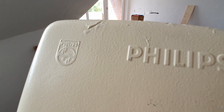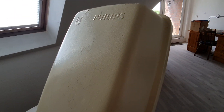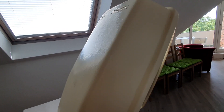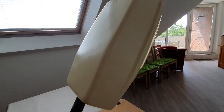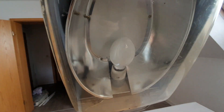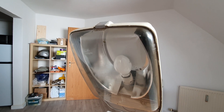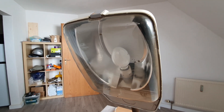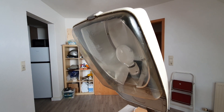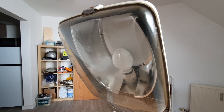The proudly embossed Philips logo here on the top of the fixture is really nice, even if I had to paint the fixture because of the glass fibers in it — not to get the itch when I want to touch it. You can still see the outline of the logo really well. The fixture has a lamp compartment with a non-prismatic bowl made of plastic. This bowl does not guide the light in any way, shape, or form because it lacks any prismatics — it's just for corrosion protection of the lamp compartment and the reflector inside.